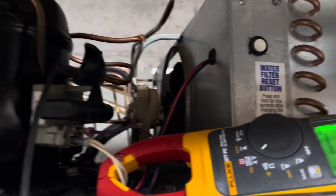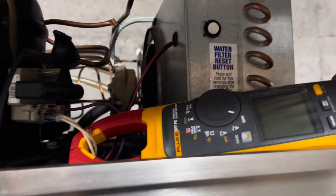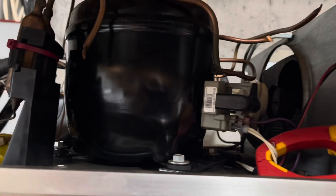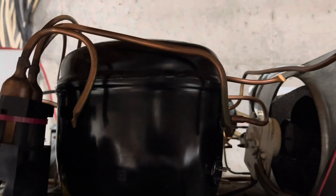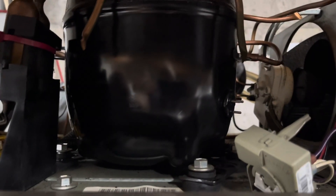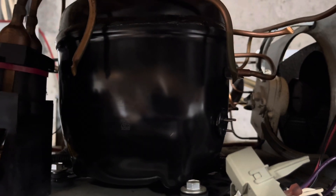Let's get the clamp off, turn this thing off, unclamp it, then remove it from the wires and you can just set it in here. This right here is your starter relay — we know that's not the problem. Actually, this is the capacitor, which could be the problem if it wasn't amping out. The motor — the compressor — now just needs to be cut away from the lines and the bolts need to come out.